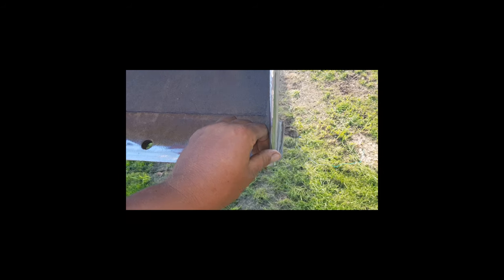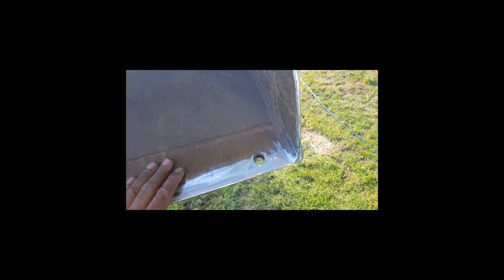I don't think that'd be normal steel. Judging by the holes in it, I'd say it was a grader blade and they've cut it and made it fit in here, because they've laid a fairly serious weld there, and it looks a lot different to normal steel. Anyway, started doing a similar thing here, put a point here so it cuts into the ground better. So I get lots of good ground that I can move really easy with this bucket, so I can actually use this as the digging bucket.